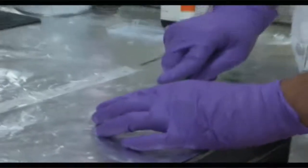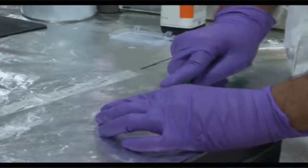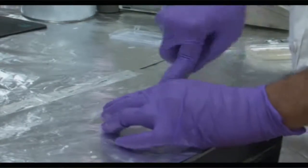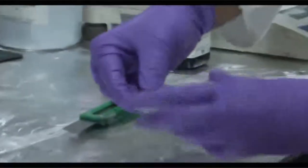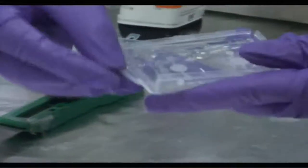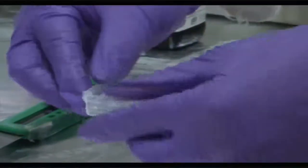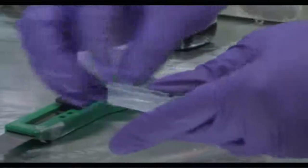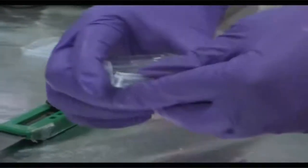and wherever there is additional cutting to be done. In fact, the box is designed in a manner which is always oversized compared to the size of the individual die which is going to replicate the device. So if need be, some sides and edges can be cleaved off. In any event, they are going to be cleaved off later once the extraction of the mold and subsequently the retrieval of the replicated part happens from this particular setup.